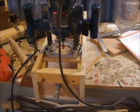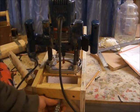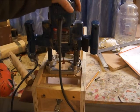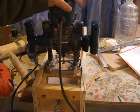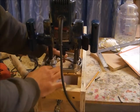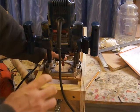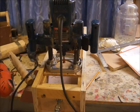We're getting this little jig almost complete. How it works is: this screw goes in and holds the thing and allows the spindle to turn, and the router plunges down through and cuts the dovetails. This type of jig has been around a long time and used a lot of times to cut this type of thing in the wood. The router just slides in place like this to cut the dovetail — it's a sliding channel. You turn this to turn the spindle, and as you turn the spindle the dovetail slides down the spindle, cutting the dovetail into it. It works real nice.